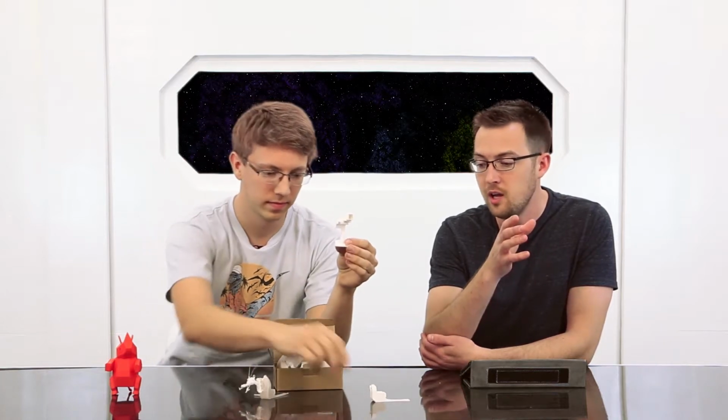Yeah, so one of the things we're going to talk about is why, when you're doing 3D printed parts for a 3D printer, you should try and stick with ABS instead of PLA. So on the table here, and Jake is being the lovely assistant holding these up, we had a fan duct on our Replicator 2 printer go out. We had, a while ago, a print where something screwed up in the code, and it actually brought the print up into the extruder, so it caused the fan duct to melt.